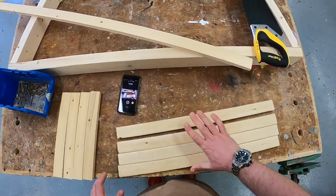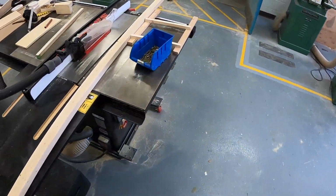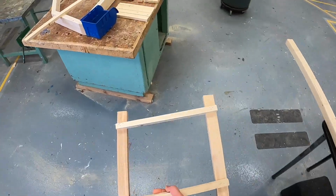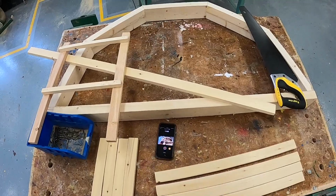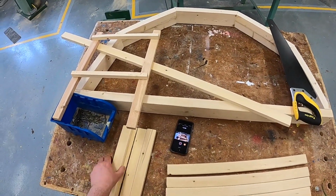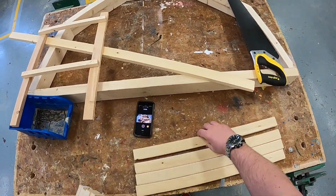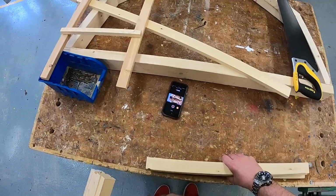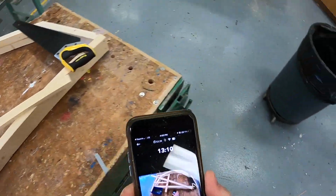There is one here on this side of the shop. It works exactly the same as that one way on the other side of the shop. So, this is a belt and disc sander. You set the guard by making sure that your piece will fit through, but your finger will not. So you'll need to lower it down just a little bit there, tighten the little screw, and my finger no longer goes through.